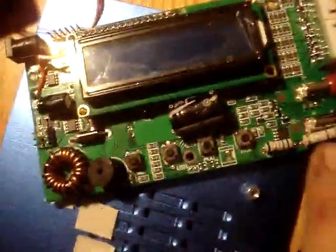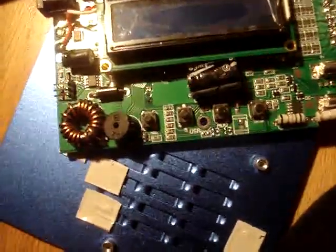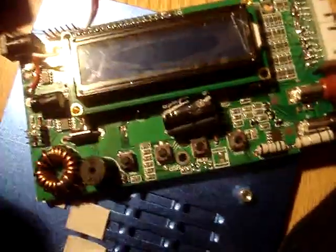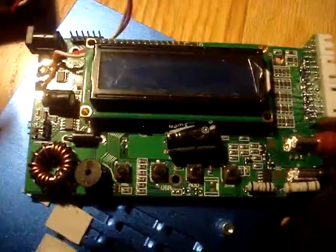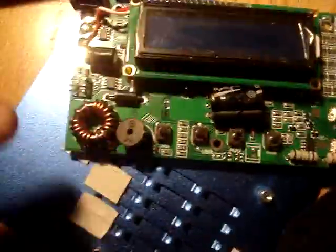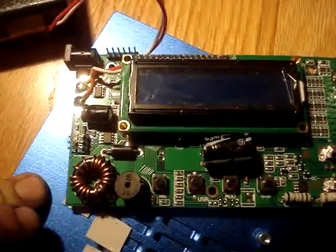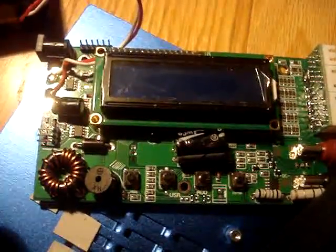So probably there's some sort of voltage divider circuitry in here that divides the voltage of the output. It divides the voltage from the output and a feedback pin to an IC, where it goes through a resistor. And then it measures the voltage on the other side of the divider with the resistor. So if I can find that resistor, I can change the value of that resistor and proportionally adjust the feedback loop. So instead of 4.29 or whatever volts, it should be 4.19.